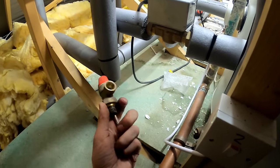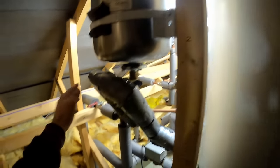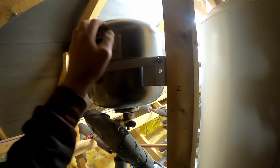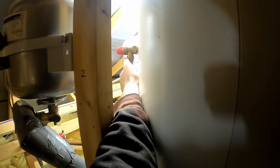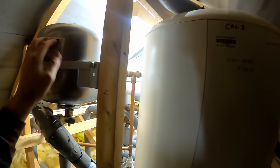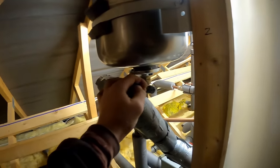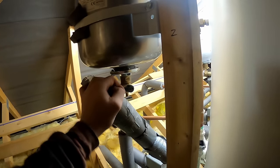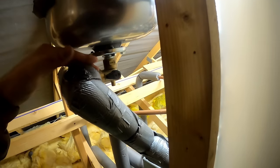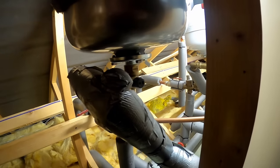That one's already had one new valve - unless that was the other cylinder. Normally if that six bar one goes off on the composite valve, it's that vessel gone. But if it's hot water coming out, it means the temperature pressure relief has gone. Now we've got the water off, we'll open that up and let that drain. We might just have to crack a bit of air in the top of the cylinder. These are a special valve on these - it's a three-way valve so it'll blow off down the bottom, so you've always got a path to vent.